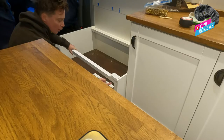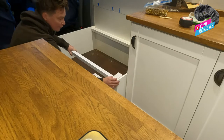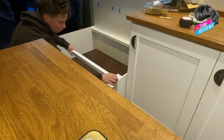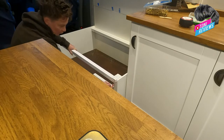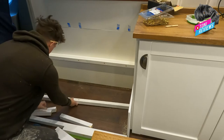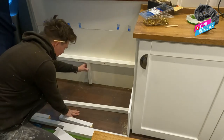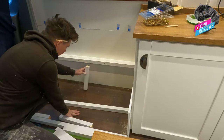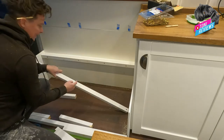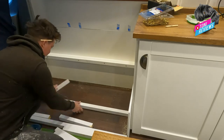So what I'm doing is using these spacers, because the spacers, that is the level that this is going to sit at. So we know we need to chop this down a little bit so that this fits within this. Right, so the idea is this bottom bit is going to sit under here, and then I'm going to have these rafters, support beams, which I'll screw in from there, and the underneath one will be screwed in from underneath. So I'm going to make sure that it fits first,